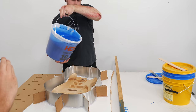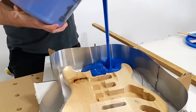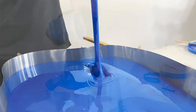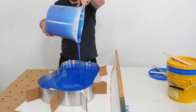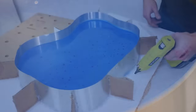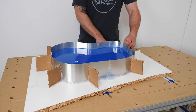After mixing, it was time for the first of many moments of truth on this project: pouring the silicone into the form. There were definitely plenty of spectators in the house for this. This was my first time making this kind of silicone mold, but based on what I'd read, pouring the silicone in one corner and letting it slowly fill in all of those voids really helps to avoid air bubbles in your final mold — and this seemed to work really well. After pouring I kept an eye on the form looking out for any leaks, and luckily there were only one or two which I was able to quickly plug with more hot glue.